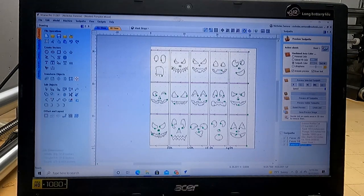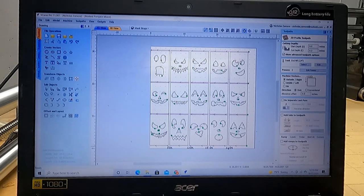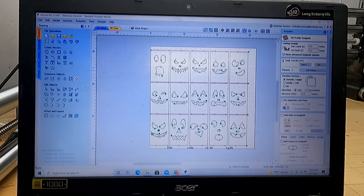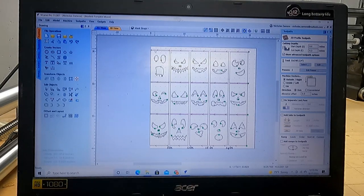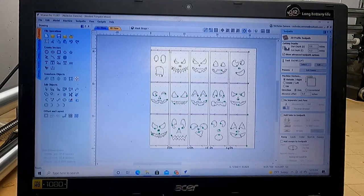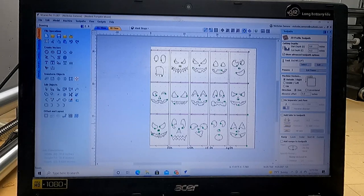With the profile cut that I've done, if it'll open, there it goes. I only cut down 2/10 of an inch with my 1/4 inch end mill. I don't actually cut all the way through these. I just leave a scored mark on them. And that's because I found that it's not worth it to me to cut all the way through these, make tabs, break those off. I'm still gonna have to do cleanup work. So just score it, let me know exactly where the line is. I take them to my chop saw, cut there, cut there, cut there, done, no big deal.